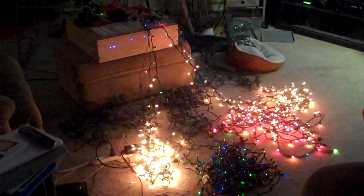The other reason I had it set to turn all the channels off if it didn't get any data from Vixen is that at the end of the sequence you don't want the lights stuck in a particular state. So you can see the sequence just ended and it shut everything down. Again, there's power leakage and that's why the LEDs are still powered, but that's it.